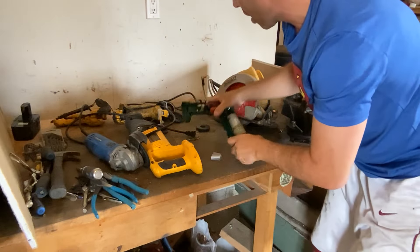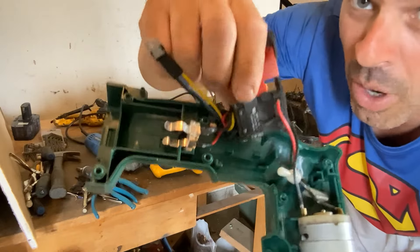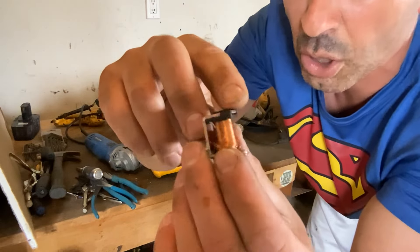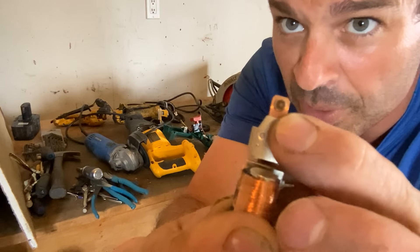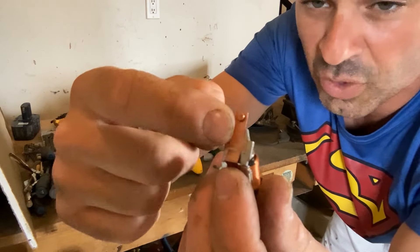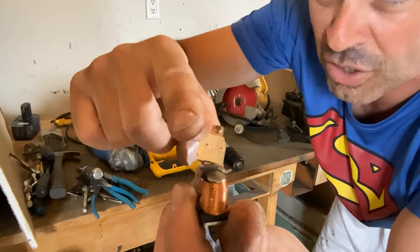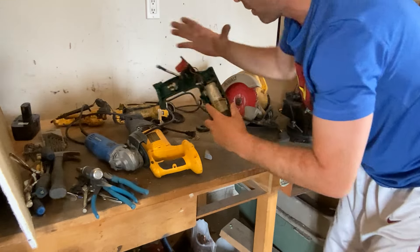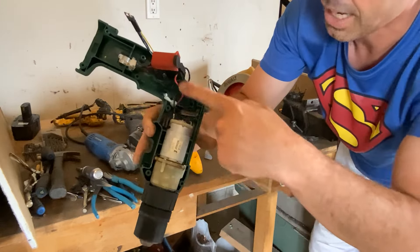But if it did have the power cord, for sure I want to make sure I pull that off. It does also have, last thing here, any type of clicky button inside this case — I want to open this because there is going to be a small piece of silver in there. I've actually just broken the case off of one of them here. This is what it's going to look like: there's going to be a small little spool of number two copper, and it's also going to have a small little dot on top of that. That little smudge on there is actually silver, and this one has a copper lip to it too. So I will pull that copper off and put it into my number two copper. All of your triggers will have in-contact boxes — a great place to find free silver if you're into micro scrapping.